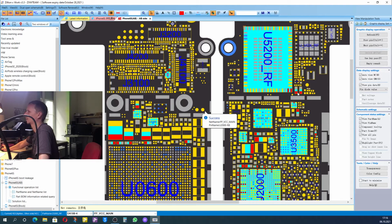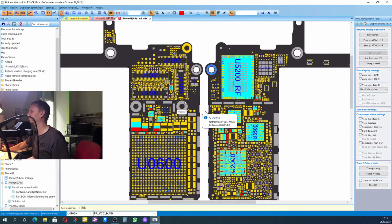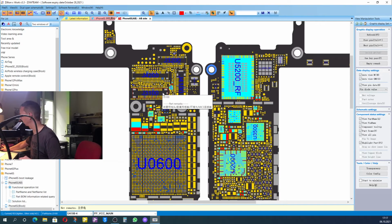We also have two caps here beside the Wi-Fi. Can be a cap here. No, that's a coil. Yeah, conclusion is, I don't know. I guess we have a broken small cap, which has burnt out and probably have more caps on that row. It must be somewhere here, because this is the area, the third on the upper side here, where we had the heat. Nowhere else. We're just powering on the power supply, not turning on the phone. It was getting warm in this area.